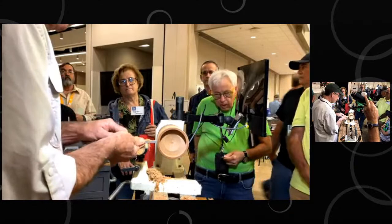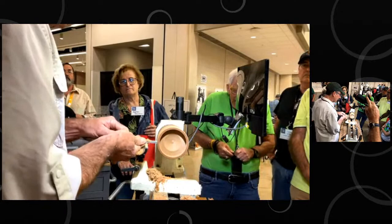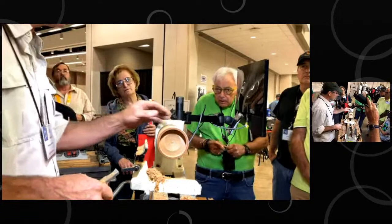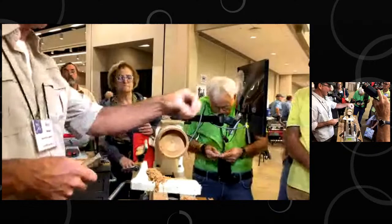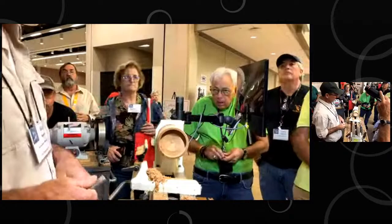Vibration there. It's going to break out the threads. But the thread's good. It's going to have some broken tops on it just because the wood isn't taking the thread. But up here in the front, it certainly works good. To mitigate that issue, I would probably take some paste wax and just keep going over to lubricate that surface to keep the break out. But that's pretty much how a male and female is done.